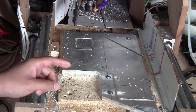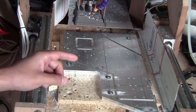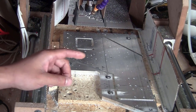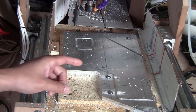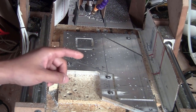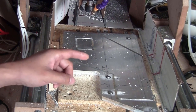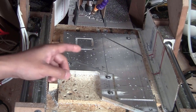I did it. The milling of the second piece was easy. I reduced the current output on the stepper motor driver and everything went smoothly, so the 2D contour was cut correctly. It only took less than 1 hour to mill this piece and 1.5 hours for the first piece. So the milling of these two pieces was pretty easy. I only needed to be careful using all the safe parameters because the stock was kind of expensive. Now we can take the pieces out, clean up the tops and show you the next step.